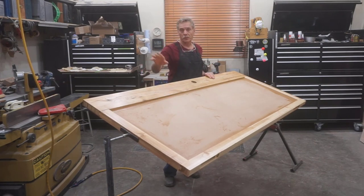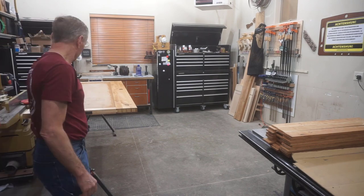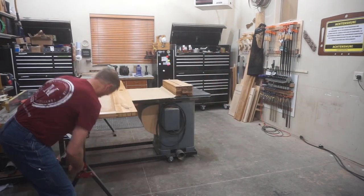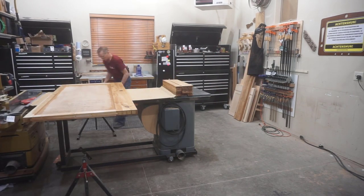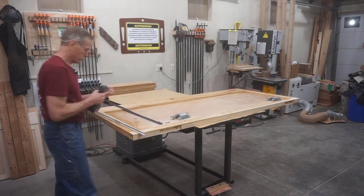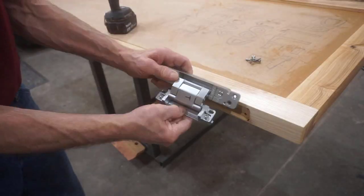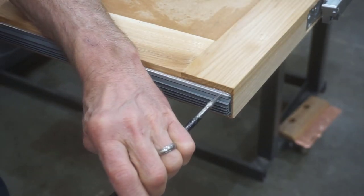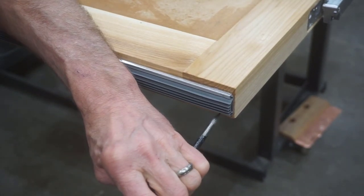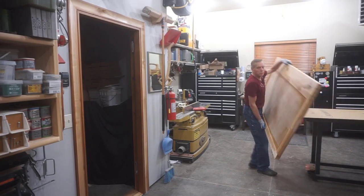I leave this to sit in the air stream from the furnace overnight so I can put the hardware back on it and stick it back in the opening. The varnish is now dry, so I can level the door out, slip the table saw back underneath the door slab, lower the stands, remove the clamps, put the door into a good working position, and then quickly reattach the door bottom and the Sugatsune hinges to the slab. I take a sharp scratch-awl and dimple the ends of the channel to hold the vinyl door bottom in place during use.